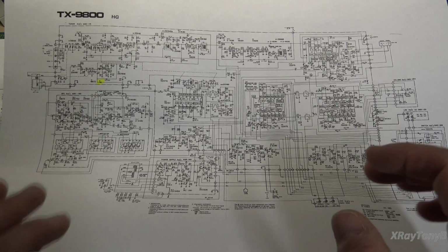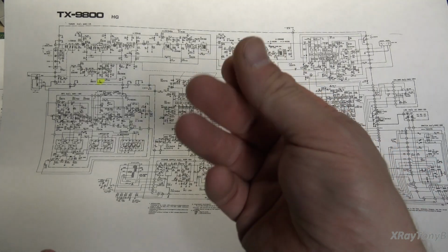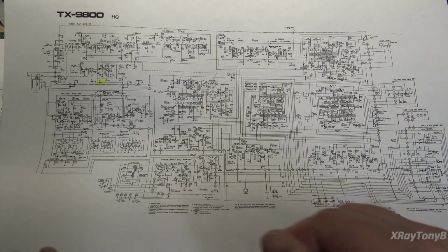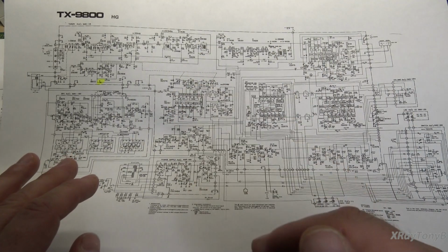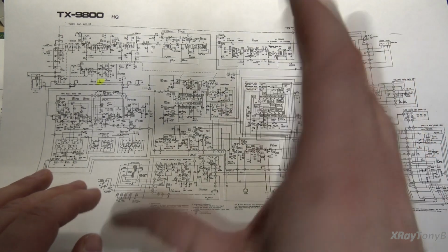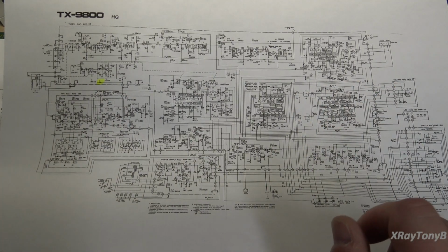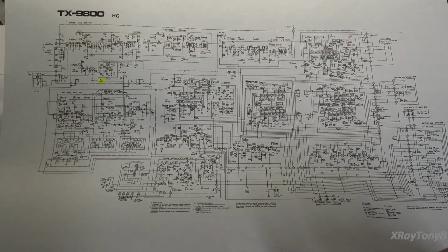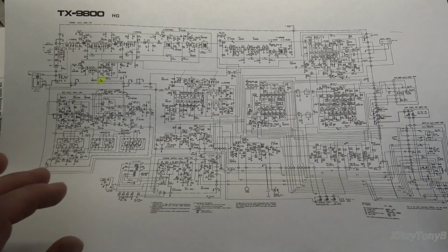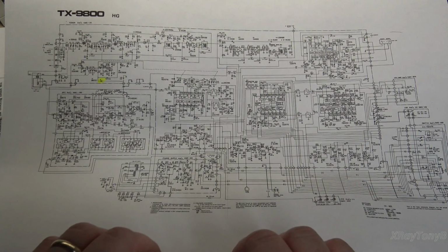And it's very unique. One of the things is it has a touch sensitive tuning knob. When you touch the tuning knob, it picks up the noise from your fingers and unlocks the automatic lock circuit that centers you in and locks you in on the channel. When you tune it, you get it roughly in, you let go, and pop, it'll pop right on. Again, fantastic little circuit. So bottom line is, for right now, we're going to get a hold of the owner of this and see what their thoughts are on having things done, and we'll go on from there.